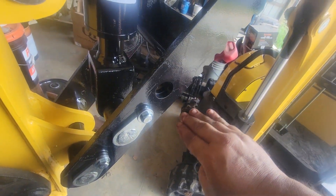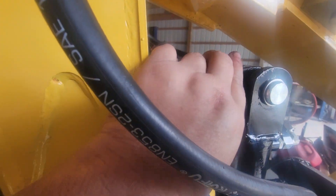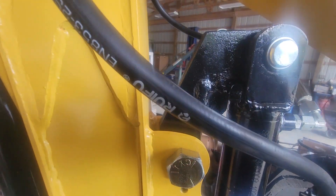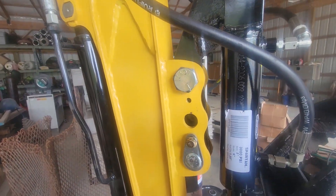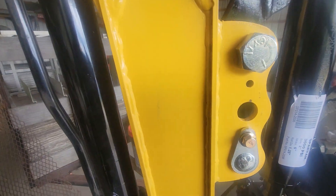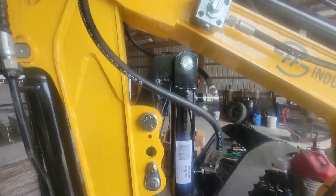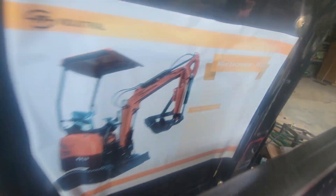If I would have put it right there, the thumb would have been way down. So I took a piece of three-quarter plate, cut it out, stuck it there, and put a gusset in it — welded another piece of three-quarter in. These pins are 25 millimeter — 25.4 is one inch — so I had to use a die grinder with a carbide burr to get the one-inch bolt to fit through it. Now we'll fire it up and show you.